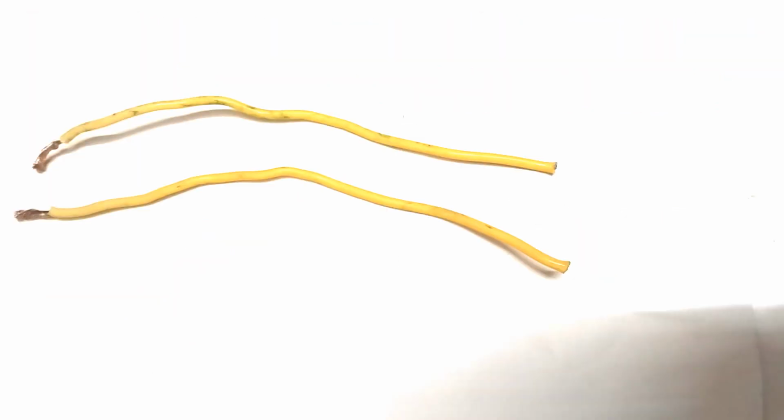Started working again on the loaded coil 80-meter dipole antenna today morning. You might wonder why only a little bit of work is done each day. The antenna trimming is not at the ends. It has to be done before the coils to adjust resonance for 20 meter. For that, I have to untie the antenna ends and pull up the antenna elements back to the terrace.